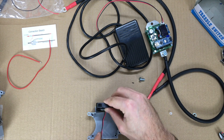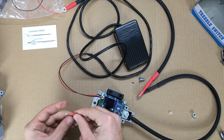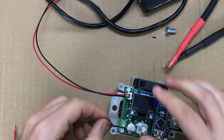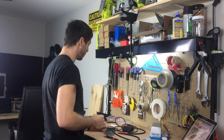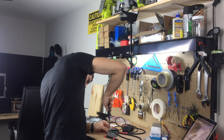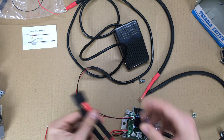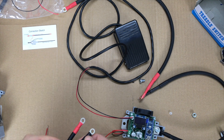Now we need the negative welding cable mounted here. Then I mount the fan in the holder. I take the red silicone wire, twist it together with the fan wire, and that goes in the left block — the 12-volt positive. The black wire goes on the minus side. I broke the tip off my knife a long time ago, and now it makes a great tiny flat head. Now we need this XT90 connector and we're going to screw the negative side to the U-shaped aluminum part.